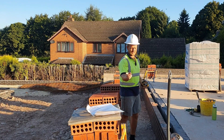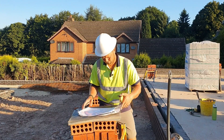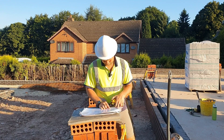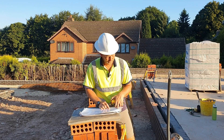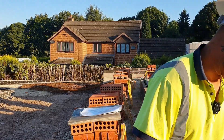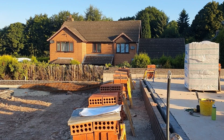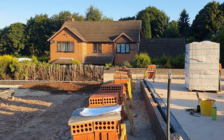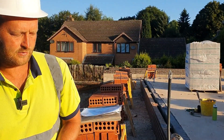I'm pretty happy with that side. Coming along the front, it's meant to be 2138mm to the start of my pier. If it's bigger, we're good. It's come in at 2145mm — bigger again. That gives me a little bit of play for the formers. Glad they've done it like that.